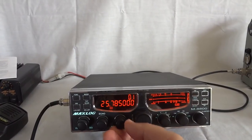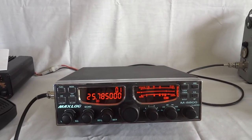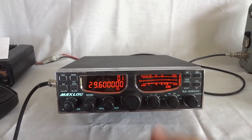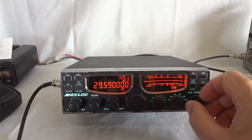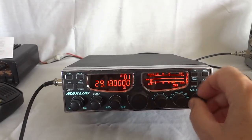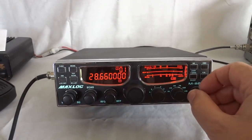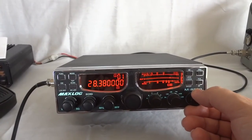You can set the power output. This is the tuning, the channel tuning, and like I said you can basically use the clarifiers as a VFO. I've programmed it that way. Not much going on at the band — I made some recordings a couple of days back when we had good propagation, so you might want to have a look at that. That is how you do the tuning.